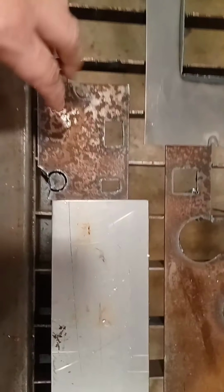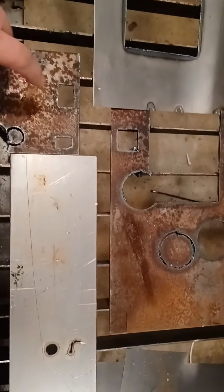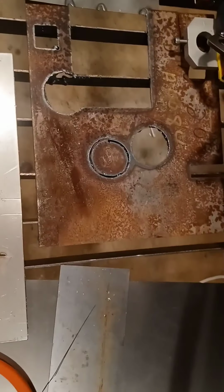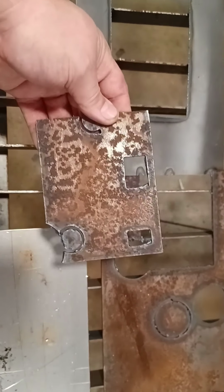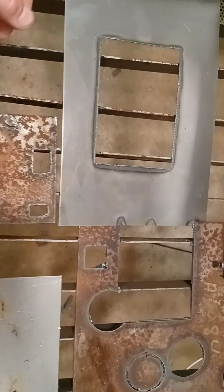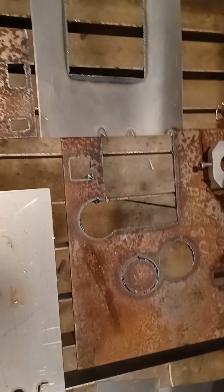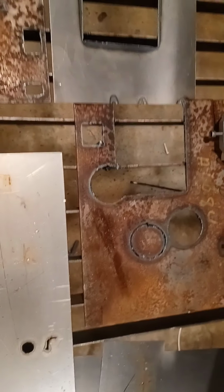I've been struggling trying to get the CNC plasma part of this table working. For some reason, I'm getting a lot of interference. I ended up using some toroid isolators, and it seems to have helped, but I'm still running into some problems with it cutting out. I'll show you some pictures when I get upstairs. For the most part, again, bear in mind, a lot of this is scrap I've cut multiple times. It's coming out okay. But still, having it cutting in and out in the middle of a cut throws everything off, because you don't want to do something that's going to be big expecting there to be a problem. So I've got some work to do and some reading up to do.